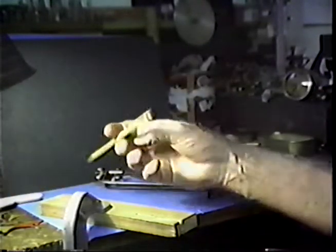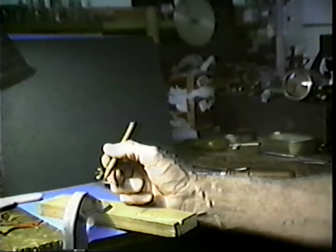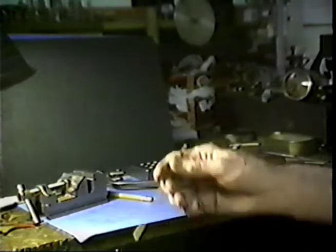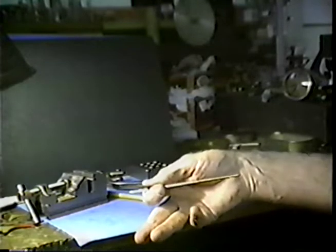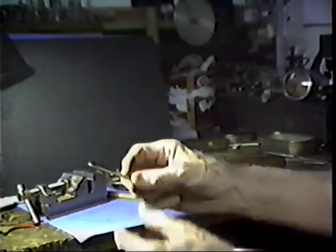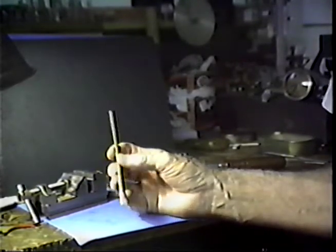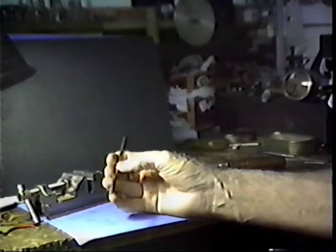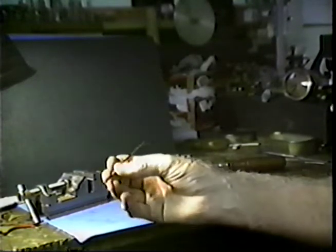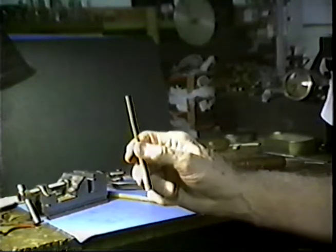This particular rod here is an eighth of an inch in diameter. This is a commercial brazing rod. They cost about sixty-five or seventy cents a piece for rods that are three feet long. I use these almost universally in making bushings for clocks. Any clock that can be bushed with a bushing approximately an eighth of an inch in diameter — I use this rod for the material. It is hard bronze.